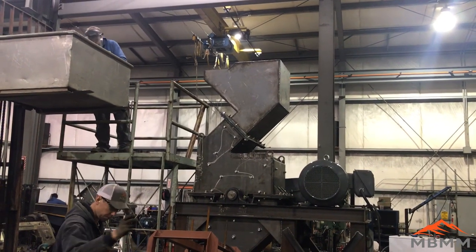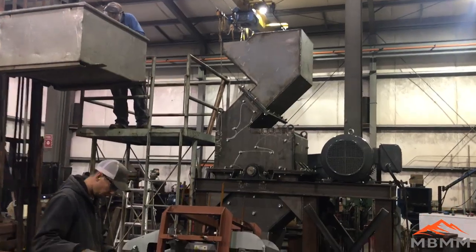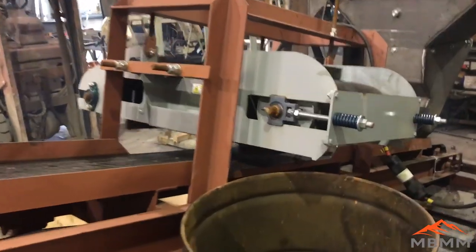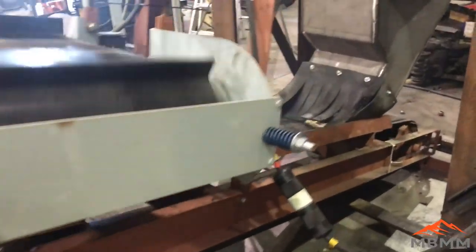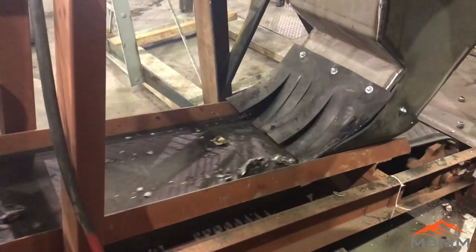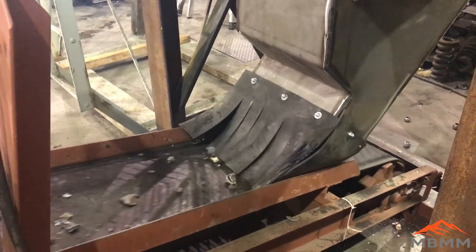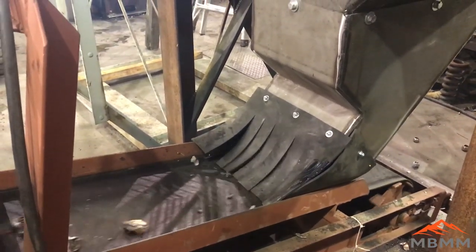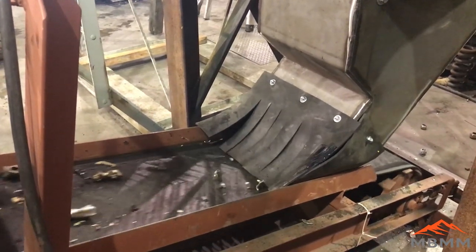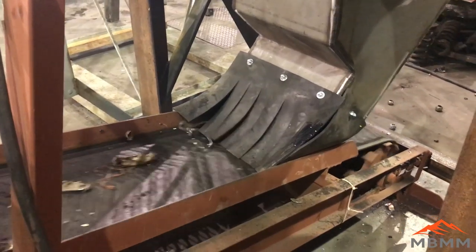This is one of our 34 by 24 inch hammer mills and we're feeding by hand in this demonstration. Inside the hammer mill is a four inch square screen that crushes the material down to size, discharges onto this conveyor, and then moves the material up under the magnetic cross belt to pull out steel. Then it can be hand-picked — the waste aluminum and stainless can be hand-picked out and the clean brass can go up the end of the conveyor and into a bin.